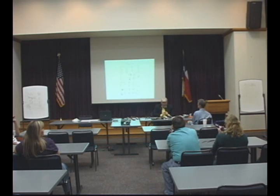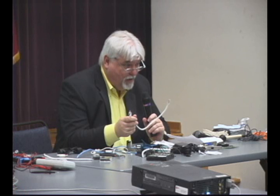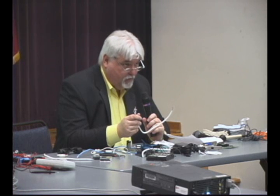Now, where did they come up with the theory of why the orange goes over to the other side? The reason that happens is — remember that balanced/unbalanced stuff I was talking about? The wires in this are using that balanced technology to avoid noise. Part of them are transmitting, part of them are receiving, and so you've got to have the transmitter go to the receiver. Vice versa, it has to be on a balanced wire. And that's the way someone chose to do it to keep it balanced.